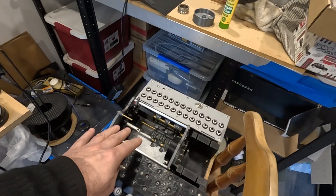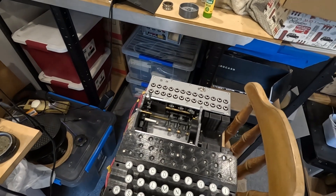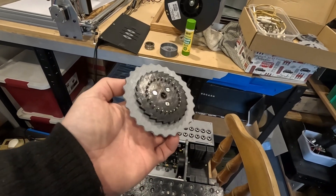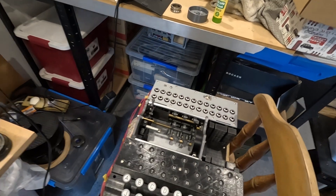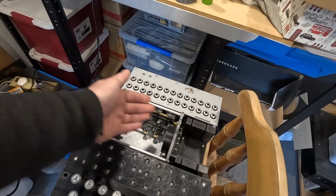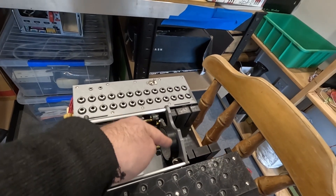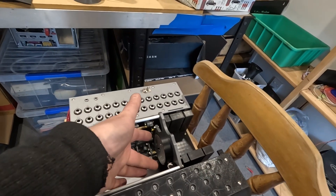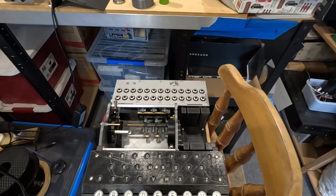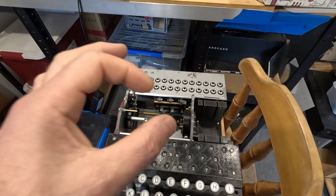I have had this machine working when I didn't have the pins in it — mechanically it does work. So what I'm considering doing, as a kind of temporary hybrid fix, is I'm going to rebuild the rotors without the pins as I had them before because mechanically they do work. I will do a similar thing to the entry wheel. I'm going to modify the input disk and basically cheat — I will take the inputs and outputs from here and run them into a microcontroller. I've made plenty of software-based Enigma machines before; I've made one in a wristwatch, I've made one into a pocket watch.